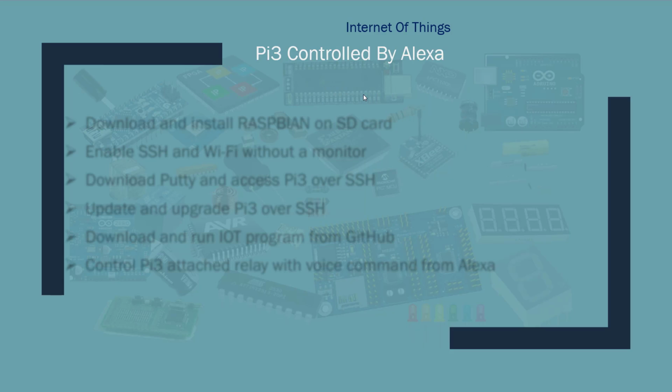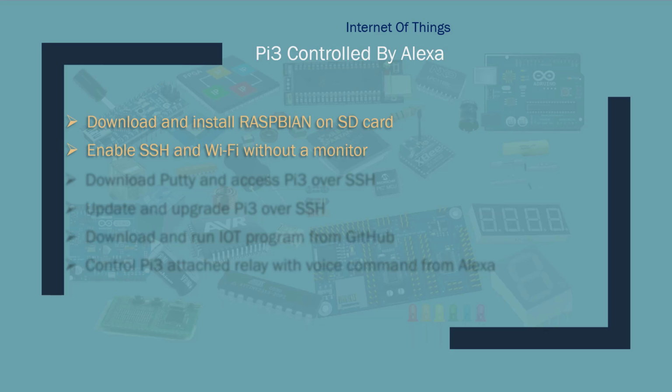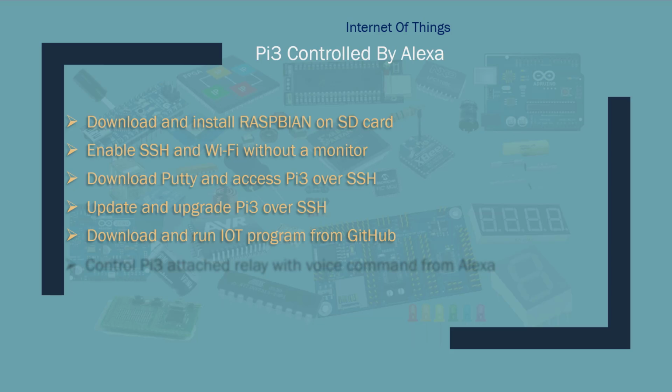So here are some of the steps we'll be doing to get this project completed. First, we will download and install Raspbian on an SD card. You will need a PC or Mac for that. Enable SSH and Wi-Fi without a monitor and connect through a VNC client. Download PuTTY and access Pi 3 over SSH to install and update software. Update and upgrade Pi 3 over SSH. Download and run IoT program from GitHub. I have already uploaded the code for this project to GitHub. I will include a link below. Control Pi 3 attached relay with voice command from Alexa.